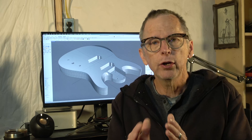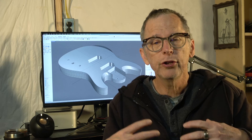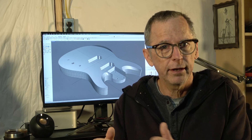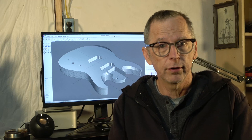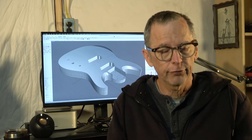When it comes to CNC, I look at it as a two-phase process. The first phase is the front end, the second phase is the back end. On the front end, that's where you're doing all your design work using CAD software — CAD stands for computer-aided design — where you use your computer to design the parts you're going to make on your CNC machine. Then you have the CAM process — computer-aided manufacturing — where you take the part designed in CAD and assign a tool path, from which you write the G-code. Once done, you transition to the back end, where you clamp your blank down to the wasteboard and feed that G-code to the CNC machine, which carves the part you designed.